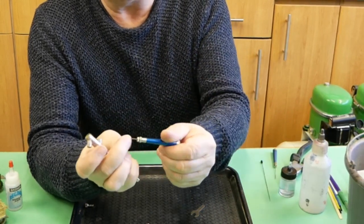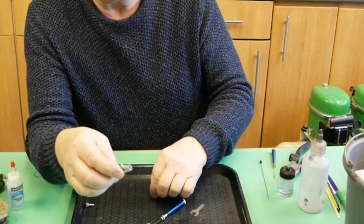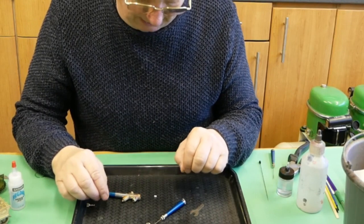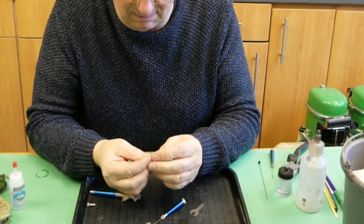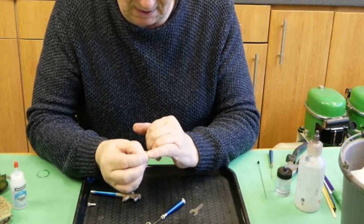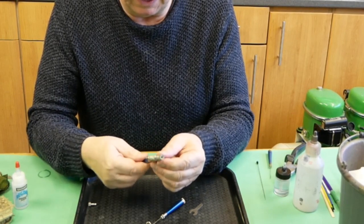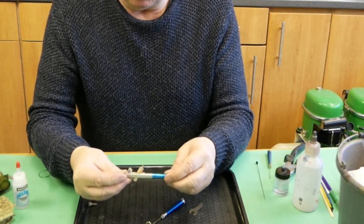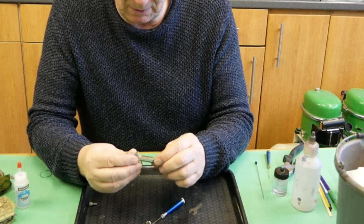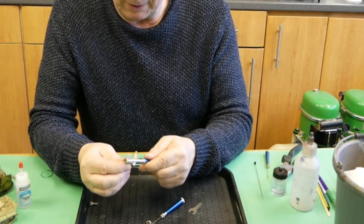That is the needle bearing there — it was almost ready to fall out. It is looking very, very thin in its actual construction, so it definitely needs a new needle bearing. As the customer said, the airbrush does need cleaning, so I'll put this one in to soak and hopefully tomorrow after it's been given a good dowsing we'll try and get all this very old paint off.